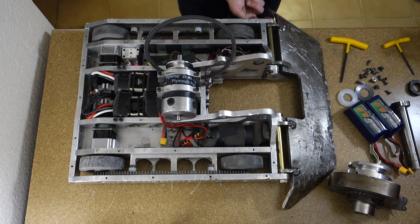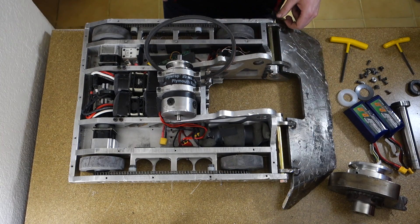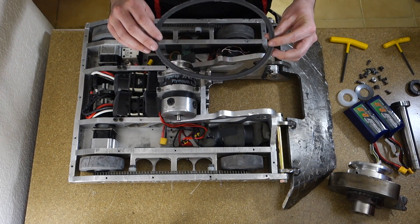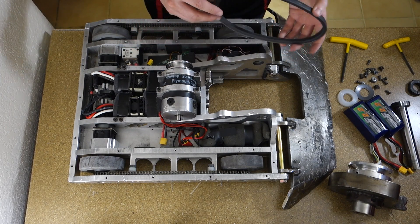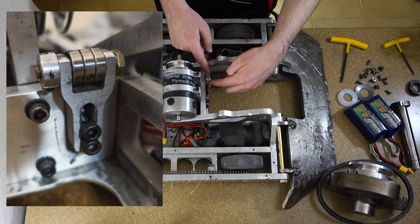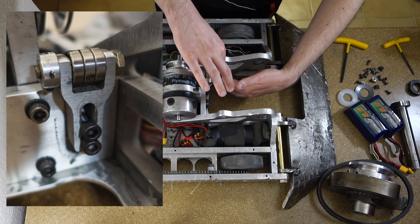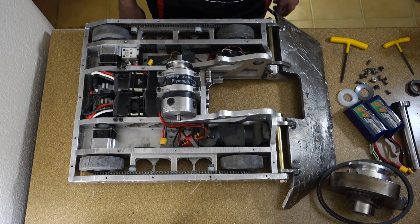There's also a set screw underneath the two frame rails. One of the unique things here — the initial version of K2 didn't have a belt tensioner, so the belt started out tight and got loose. I added a belt tensioner to the new version: it's a little fork with a bolt running through it with some bearings, and screws I can adjust to slide it up and down to set the tension. It's worked out pretty well so far.